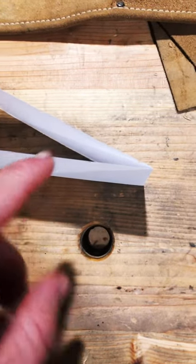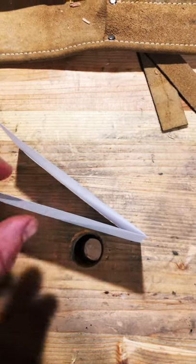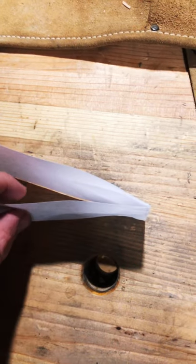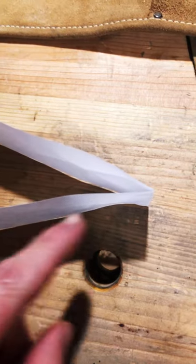Quick overview. This is what you're going for: two planes intersecting at about 25 to 30 degrees, which is a good mix between strength and overall sharpness. This represents a chisel that needs sharpening — a lot of variations, definitely not two planes intersecting nicely.